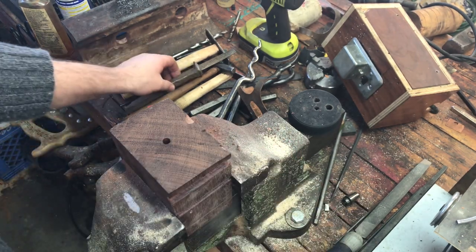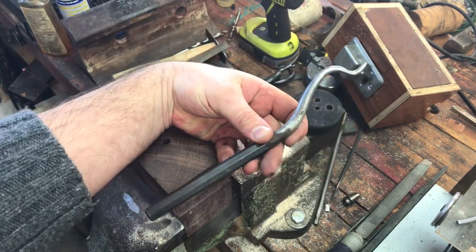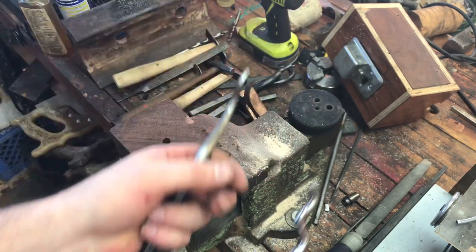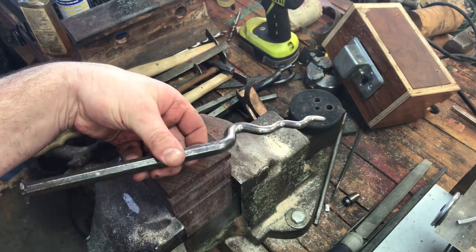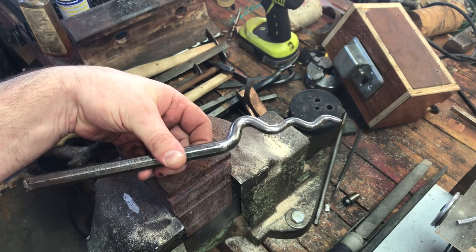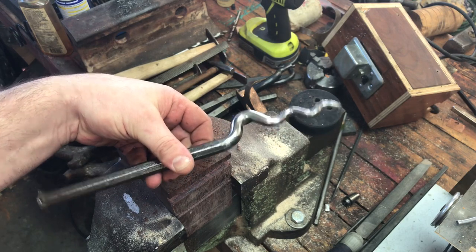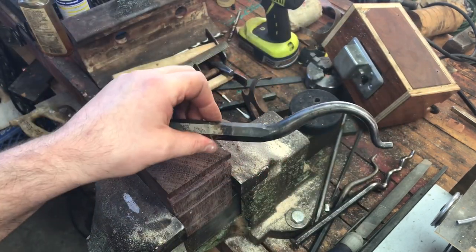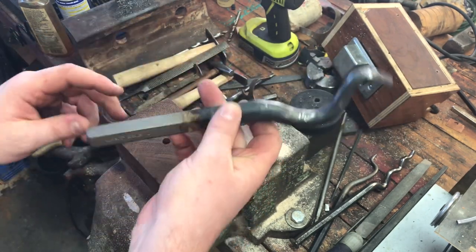These ones were automotive punches or machinist punches that I heated up with a torch and then just bent and polished, so that I can stick that in my vice and then form around it. There's another one — takes a little bit of getting used to trying to get those lines and curves right. But you can make yourself a pretty useful tool by just going down to Home Depot or Lowe's and getting some — usually they're called locating punches. And then I made that one too.